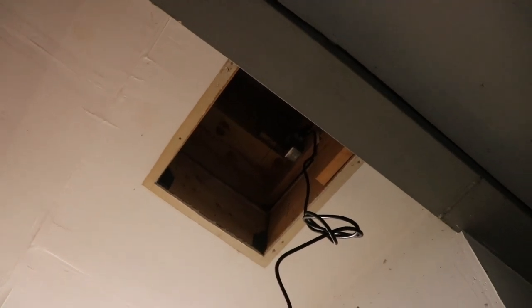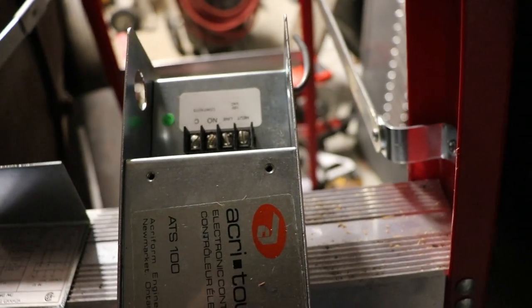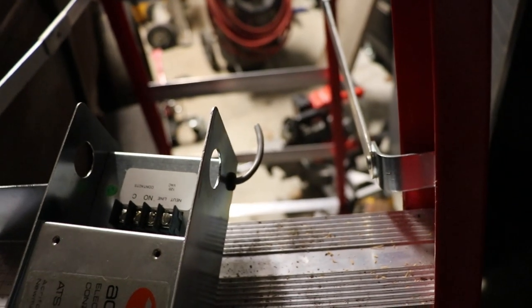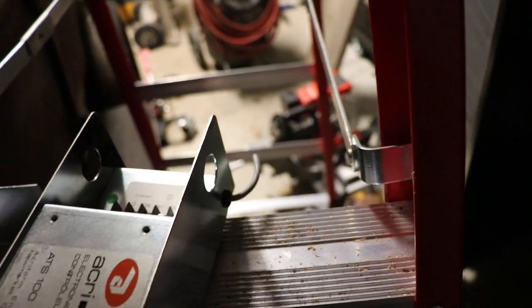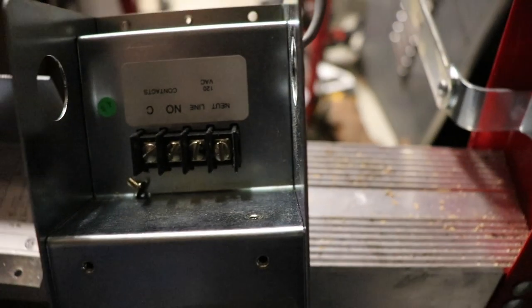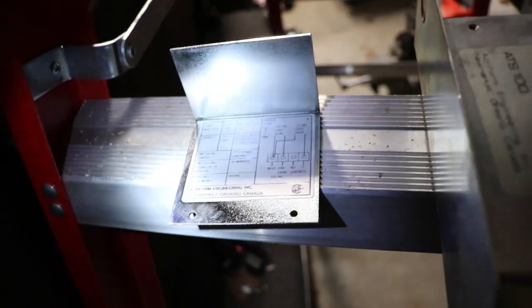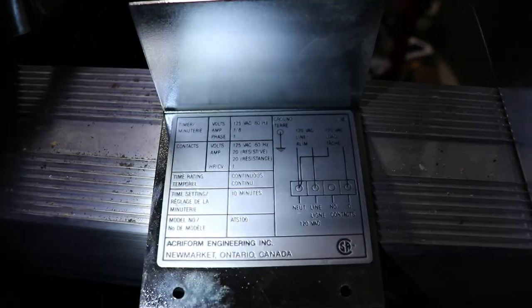Welcome to my garage. The motor and the tub are up there about 10 feet from the ceiling level and another 2 feet up, so it's like 12 feet off the ground to get up to the motor. This is the Acroform AcroTouch ATS-100 starter - that was the original system from the 80s. You can see there's a little gray wire that I chopped off that goes up to the touch button in the tub. There are two knockouts on this box where you do the wiring - you join your neutrals, there's a ground bar lug there, and on the back of the cover there are instructions on how it would have been wired initially.